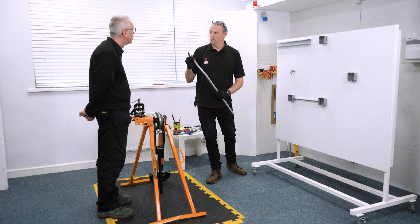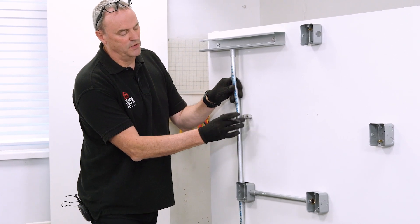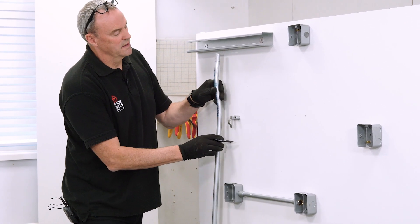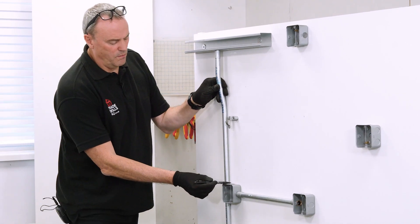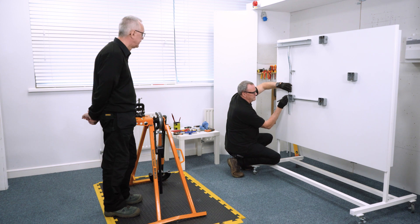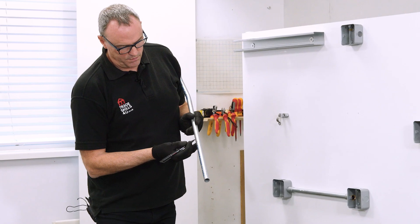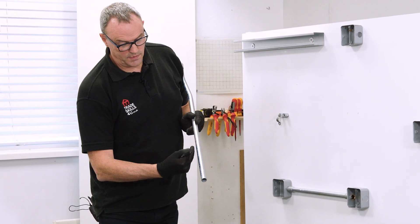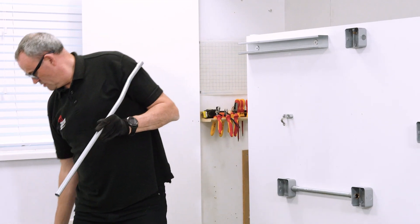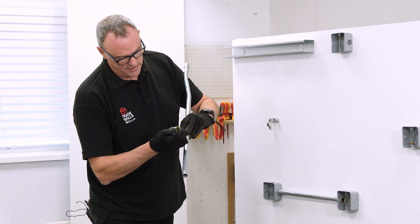It's been cut and I've threaded the end and put the coupling on, so it's going to fit just up there. But we need to address where this is going to be fixed. I've also put a saddle on just underneath where the bend will be to support it — it also stops a bit of the twist. Now I need to mark where this is going to go: I'll come down and mark where it's roughly flush, then allow approximately 15 millimetres back when I cut it, because I've got to allow for the coupling and the bush. I'll cut it approximately halfway — there's where I'm going to cut it.